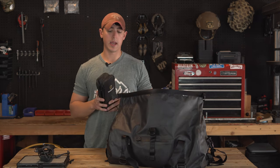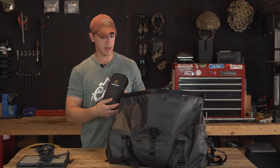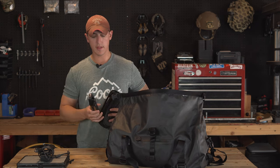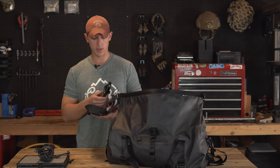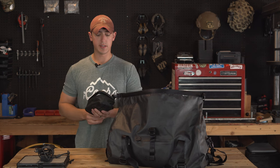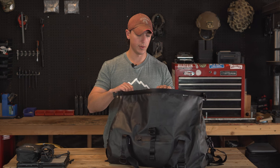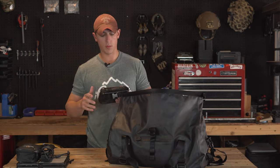One of the tools I like to keep in the bag is a nice multimeter — this one is a Southwire multimeter that I got from a radio course. It gives you everything you may need to troubleshoot radio equipment. One of the primary things I use it for is determining if cables are good: you can simply use the resistance function to determine if you have a short in a cable.